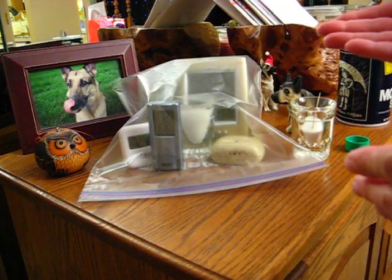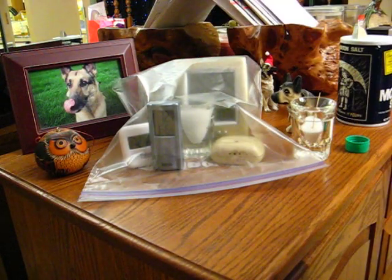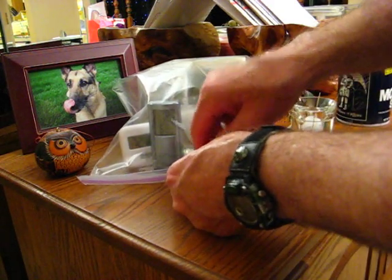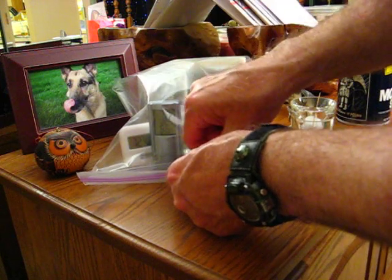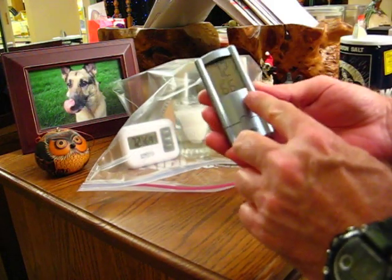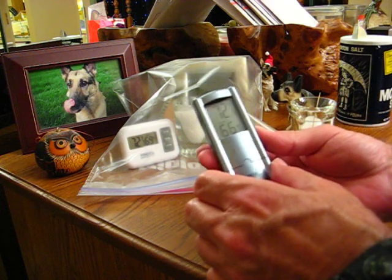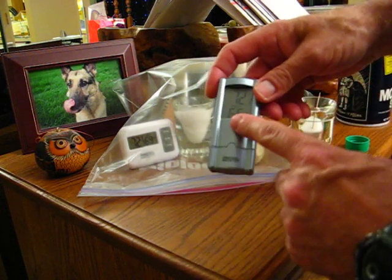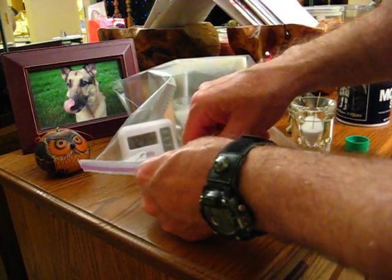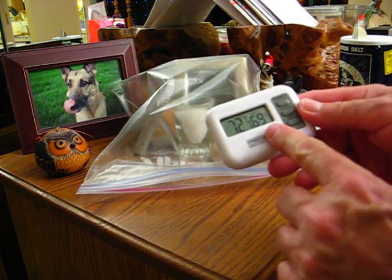They should all reach 75%, and I have never found one that reads the same as the others. All you have to do is add whatever offset it is. I've already written them down — they're all a little low. This Springfield device reads about 66% relative humidity. I happen to like digital hygrometers.